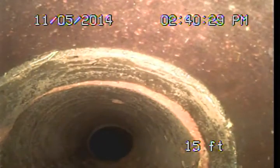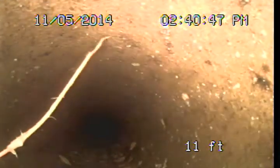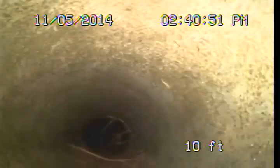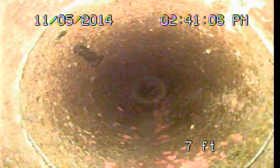The pipe's cracked all the way around the circumference and it's starting to shift a little bit. Stress on the pipe is starting to cause damage. There's more minor stress cracking here just past this joint — that'll very likely look similar in the next few years. The remnant roots are pretty typical. It's clean and definitely draining now, but there's a bit of stress cracking around these areas where the roots were.